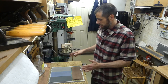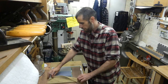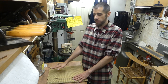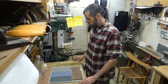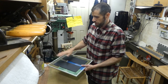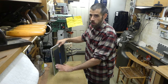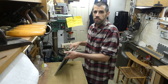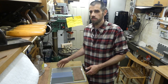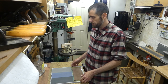I think that's going to be a good solution for me. I can wrap it up in this piece of anti-slip matting and store it under the bench so it stays clean and dust-free. When using the harsher abrasives on the back I'd put some kitchen towel on here so I'm not transferring abrasives from one side to the other — if I get 240 grit contaminating the 1000 grit side it's not a 1000 grit surface anymore, so you've got to be careful about cross-contamination.